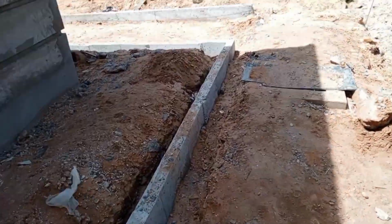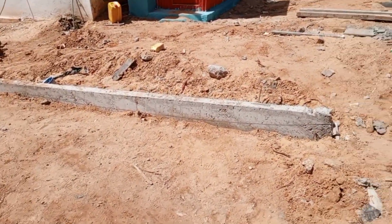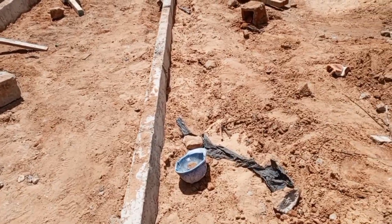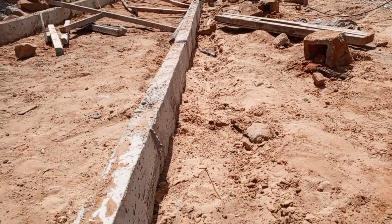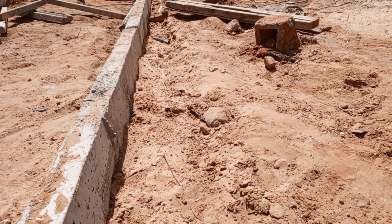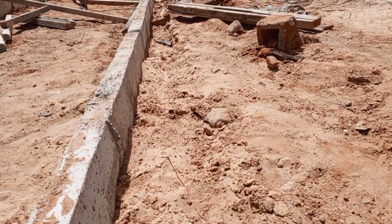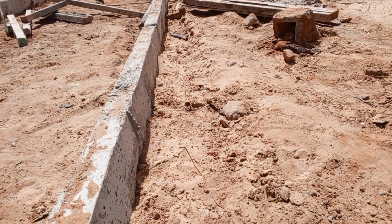And I've been told that the way they will do it is that they will have an excavation along this channel, because on this side is where we are having our drainage. After doing that excavation, they will provide formwork on the sides, not at the bottom, only on the sides. And in fact, on this one side, maybe this channel can work as part of the formwork.